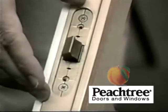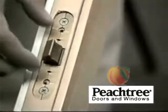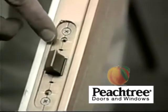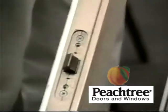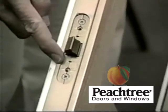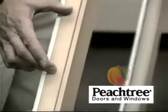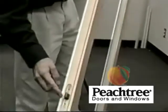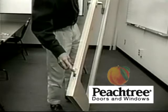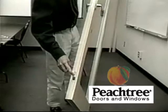Again, the modules are reversible, okay, so they could be installed either way. And I'll show you how the bolts are reversible when we take it apart. But it's important to note these slots, because the alignment key will be installed into the upper slot when synchronizing the top rod and the bottom rod. The alignment key again will be installed in the upper slot, which would be this one, when installing the drive rods and aligning the drive rod to be secured.